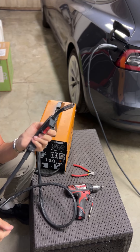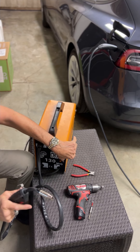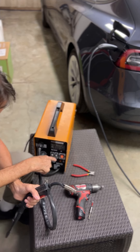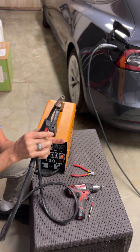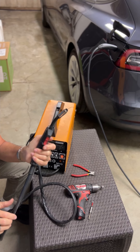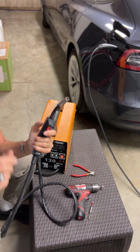Today we're going to go over how to easily change the fuse. We have it plugged in and turned on — the fan is running, all the lights are on, it should be ready to weld, but when you press the button you should get wire feed and you don't. If that's your situation, you may just need to replace a little fuse.